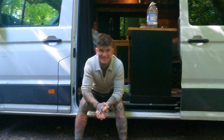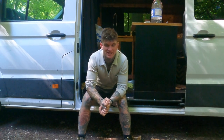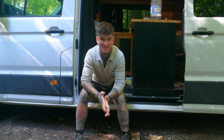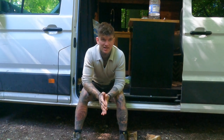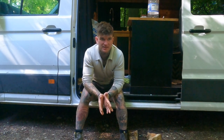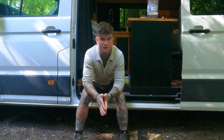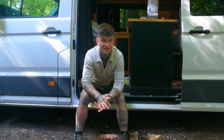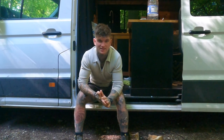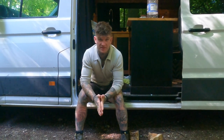You've just found out how slow it is, haven't you? Yeah, on the gables. Traditional gables, yeah. So I was just explaining to Amy, I thought I'd just reiterate it on here. When you're on price, gable ends are pretty easy once you know how to do it, but when you have big lifts, like first lifts and third lifts, you need to be getting plenty done, because if you're on price, the gables can soon eat away at your money if you're not experienced in doing them.